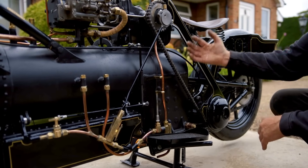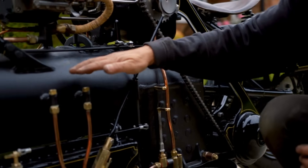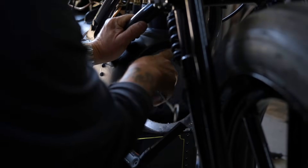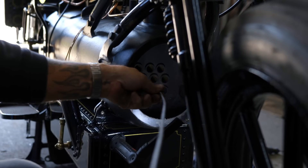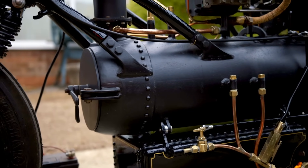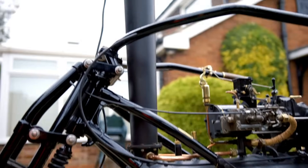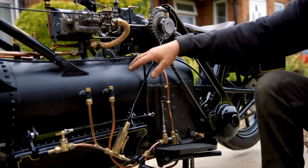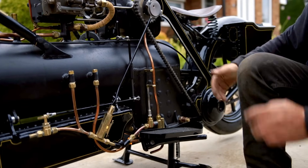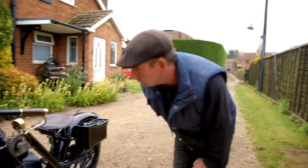And then instead of going straight up a chimney like in your house, it goes through some tubes. Inside this boiler are 18 tubes that carry on through the end here. The boiler stops there, and this is the smoke box. All the hot smoke and heat off the fire goes into this void and up the chimney, and as it's passing through, it's heating all the water up inside the main boiler part, as well as all around the firebox walls.